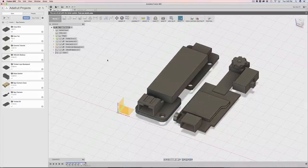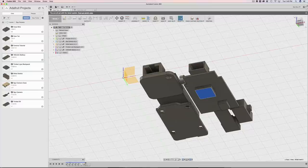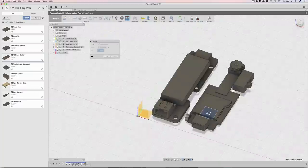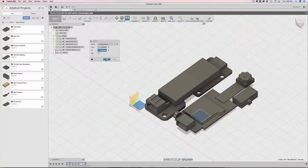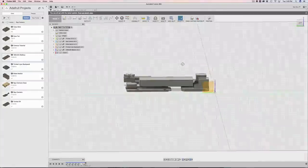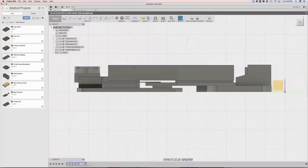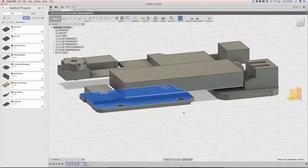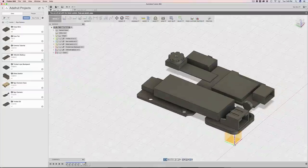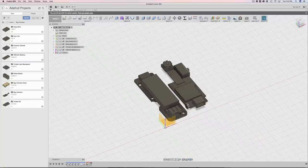For the spy camera, I actually need to align the chip surface - not the top surface - because the chip is going to be touching the floor of the enclosure. After aligning, from the front view you can see everything is nice and flat. The battery looks okay - clicking on it and the trinket while holding shift shows a distance of 2 millimeters, which is plenty of room for 30-gauge wire underneath. I'll accept that position and we've made everything flush with the enclosure floor.